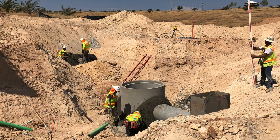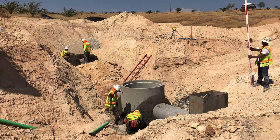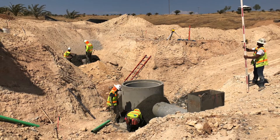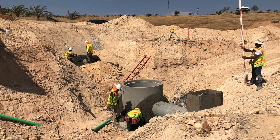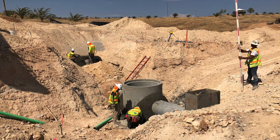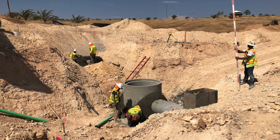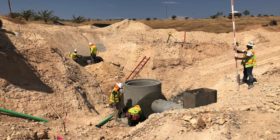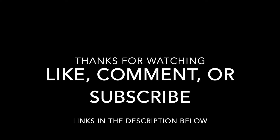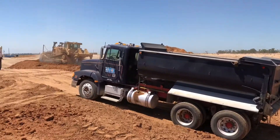Finally, this last picture shows probably one of the most common areas you'll see an underground crew working. They just finished pouring a base for a manhole — you typically see those in the streets covered by a metal grate, but this is what it looks like at the very bottom. There's pipe coming in on either side; this particular set is a storm drain and they're about to pour the drain inlet just to the right of the picture. You have a few laborers finishing the concrete joints and a foreman overseeing the work and grades of these components. That's all for this video — thanks for watching, please like, comment, or subscribe, or email questions directly to the email from the beginning of the video.